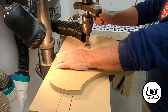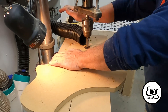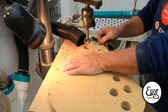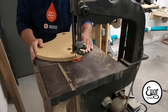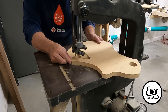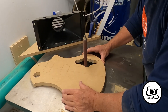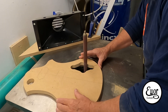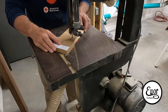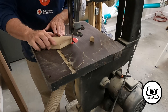I'm using an inch-and-a-quarter Forstner bit and drilling out the four points — basically the corners — of the control cavity. It's essentially a parallelogram with four controls: two volumes and two tones. I cut in with my band saw to get into it, but I'll take a piece of veneer later and glue it back in that little space the bandsaw blade went through to lock it back together. Now I'm just straightening it up — the funny shape leaves little ledges around the edge to have plenty of room to put the screws in. I'm also making the control cavity cover and still have one more template to make for the recess for the control cavity cover.